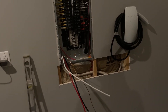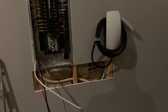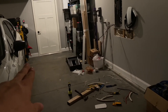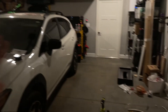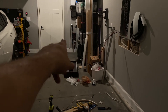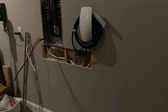This took me about an hour or two just to get into the wall and figure this out, but now I'm in a good spot. The charger is about 48 inches off the ground — they recommend a minimum height of 45 and a maximum of 60, so I think it's a good height. Typically I back my car in. I don't have a Tesla yet — I ordered one and wanted to have this on the wall before I get it. I'll be on this side of the garage and I'll be able to charge on the driver's side back corner. I got the 18-foot cable so it'll reach this back corner whether I pull in or back in.